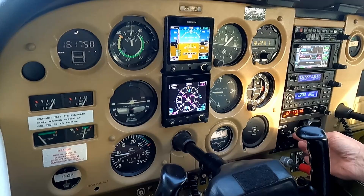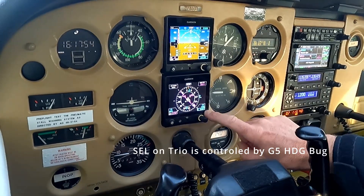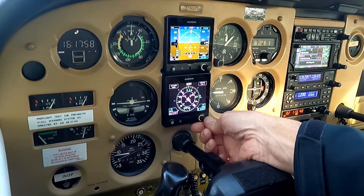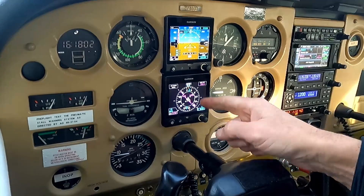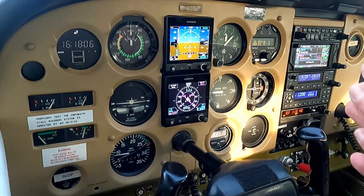With the G5 switch enabled, it has not sensed the movement of the heading bug. The heading bug is at 124. I'm going to set it to 039 just by pressing and holding. It puts it up at the top, and now it knows that heading is at 039, if that's the direction I wanted to go.